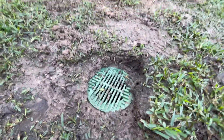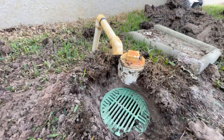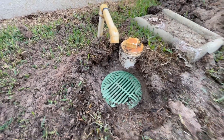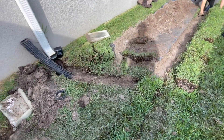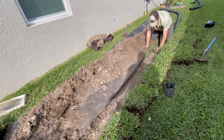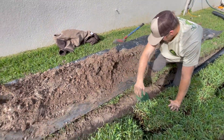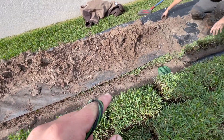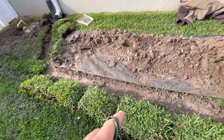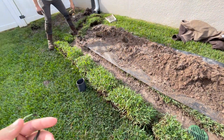Joe's back there feeling it already. You can see whenever he does catch basins, he puts a bowl around it — it needs to be in the lowest point of the yard for these catch basins to work properly. Right here at the drip line it's in a bowl, so all that water is going to go down that catch basin and into the drainage system. Just need to chop off the bottom part of that downspout and get the adapter on. He's got the perforated part already filled, dirt back on. If you have good soil, try to use the good soil on top of that perforated pipe — it's made for catching water that absorbs through the soil, so if you put compact clay on top, it's not going to work like it's supposed to.